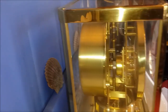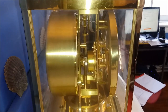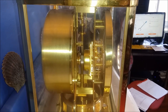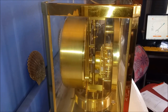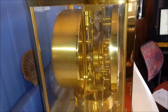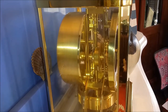The only real difference is that big cup in the back, on the left hand side of your screen, that has a bellows in it. The bellows contract and expand based on temperature differentials. The Atmos clocks today have ethyl chloride in them, which boils at around 50 degrees Fahrenheit. So in our atmosphere, it would be gas.